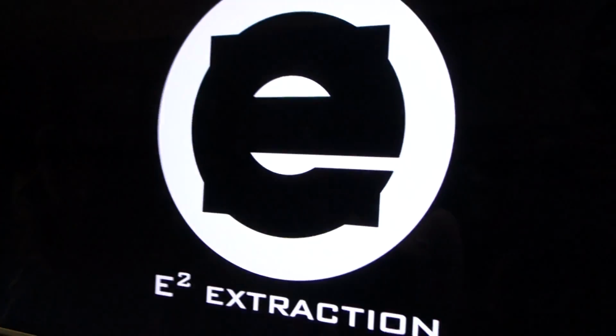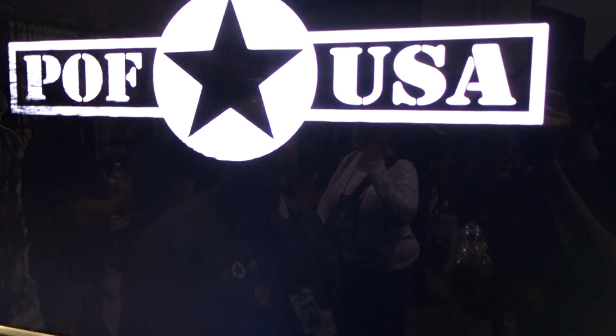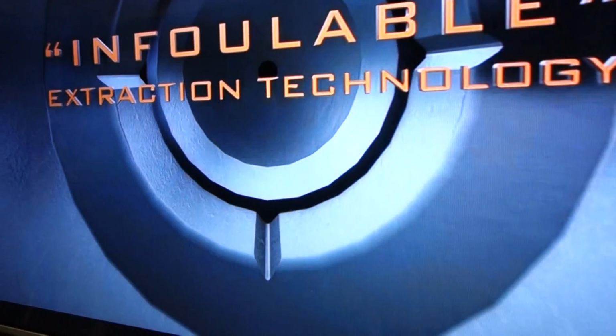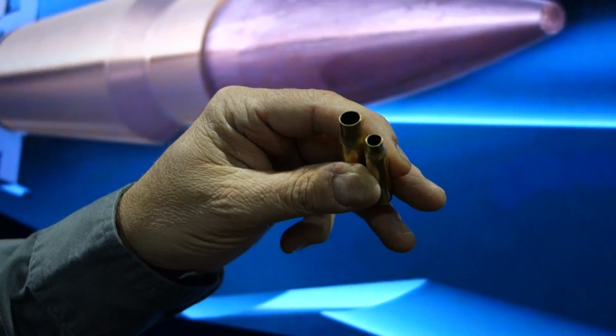Right, and solving the extractor issue, you're solving at least half the battle. You're essentially floating the cartridge out of the chamber with gases surrounding the case. In other words, you're achieving what HK did with fluting. It is different, totally different, because we're not destroying the case. Totally reloadable. I just mean the effect of it, floating the cartridge out. This is a much better system, so you can reload these cases.